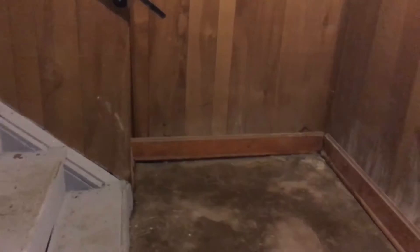It's not like the tenants probably need to go down here much — maybe laundry. But this wooden beadboard down here has gotten wet and has got some mildew. You get dampness on the floor coming around it. I noticed this whole side, and I took a picture outside — they have fixed the grade so water is coming away from the foundation. I think the problem of water coming in might be fixed, but this all needs to go to be safe. It's got kind of a musty smell down here.